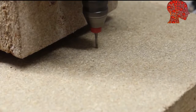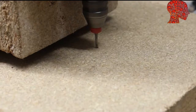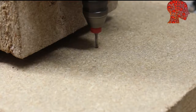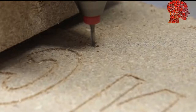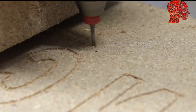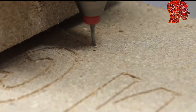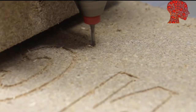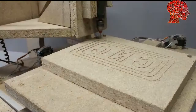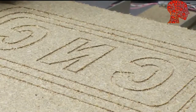You can also engrave wood. Here I am engraving 20mm chipboard as used for the frame of the machine. The mechanism of the CNC isn't ideally plane and the drive doesn't move ideally in parallel to the base plate. As a result, the router is diving into the material with varying depth when moving along a path. You must have a close look at the blade to notice that error.